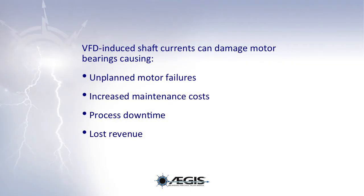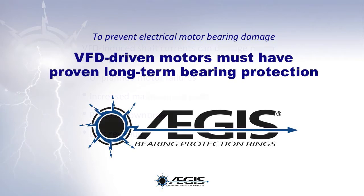Shaft voltages, or bearing currents, are present in AC motors operated by variable frequency drives, or VFDs. These shaft voltages can discharge through motor bearings, causing electrical discharge machining and resulting in unplanned motor failures, increased maintenance cost, process downtime, and lost revenue. To prevent electrical motor bearing damage, VFD-driven motors must have proven long-term bearing protection, such as the EST-AEGIS bearing protection